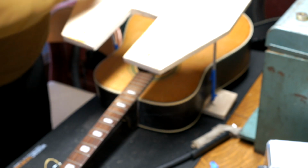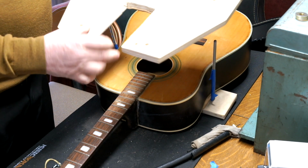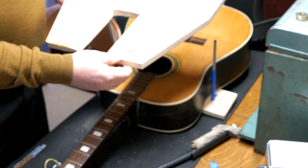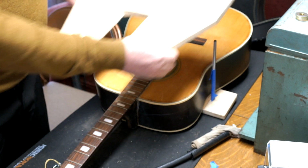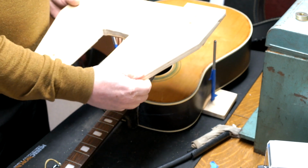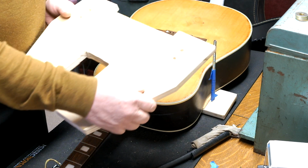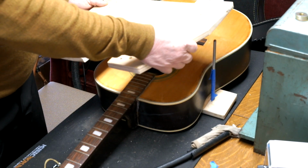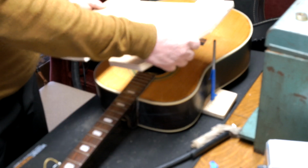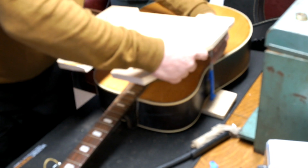This is 13 inches deep. It's got a 6 inch by 3 inch wide space for the fretboard, and I've cut a little bit for the jig because I found when I originally had it, it wouldn't pull back far enough. So in order to allow it space to move back and forth, I've cut this for the bridge. This will thread on here like this onto this jig.